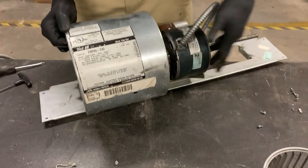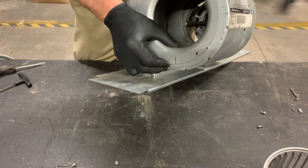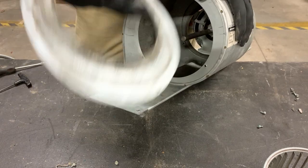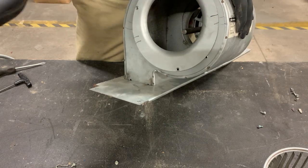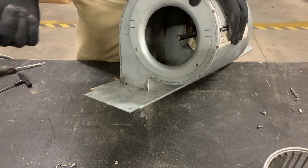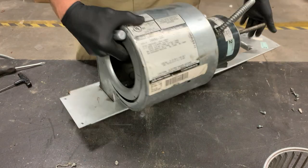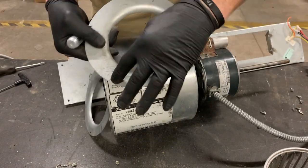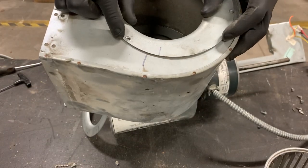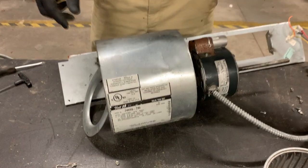Also on the sides, you have your caps that go on the ends of your unit. As you can see, this one has two little marks on it and I have two marks on here. This lets me know that the two marks are on the right side and which way it goes, because these are not unidirectional — they have to go back in the same way they came out. So I take a Sharpie and I mark two marks on one side, and on the other side I have one and one. Whenever we go back and put it back together, they line up.